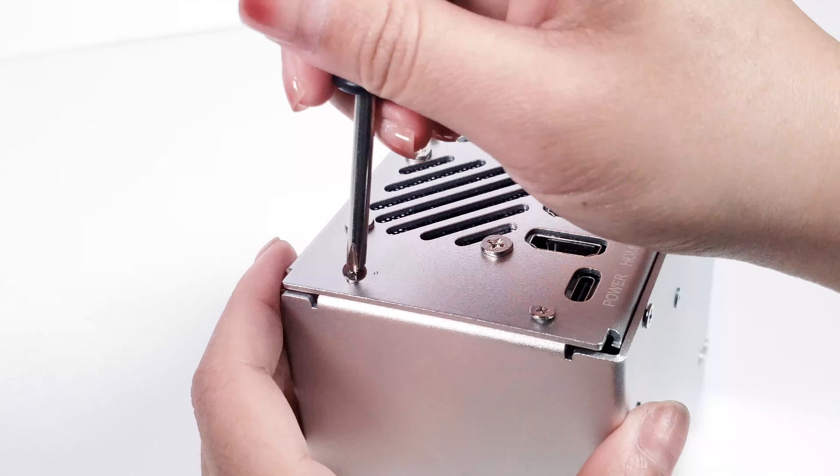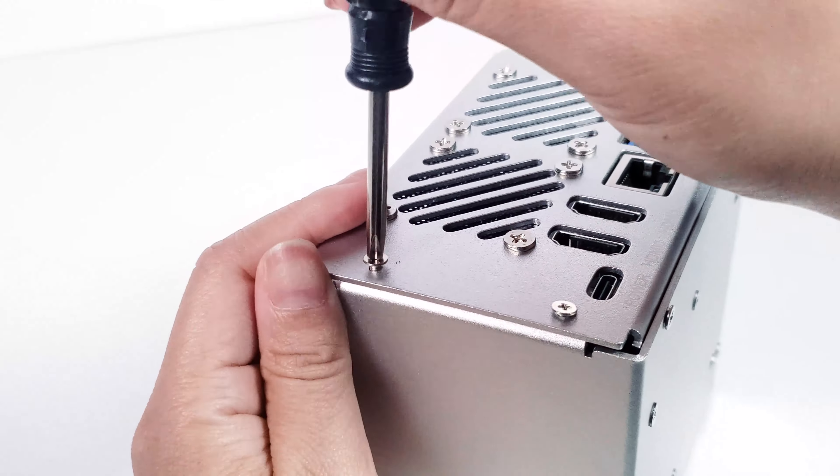Then plug in a 4-pin header and plug in a 2-pin wire. Lift the brown clip of the connector, insert the FPC cable, and press down a few times to ensure a secure connection. Secure the connected boards to Plate B with 4 M2.5 standoffs and 2 M2.5 screws.